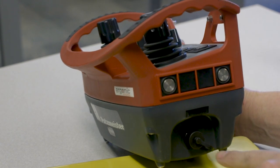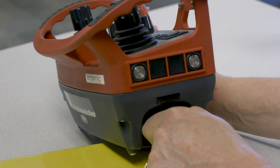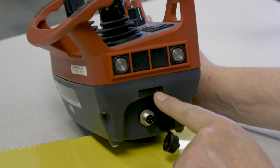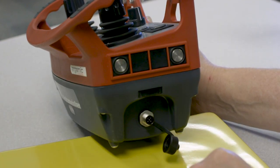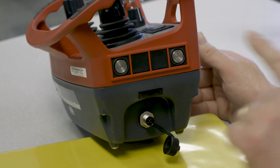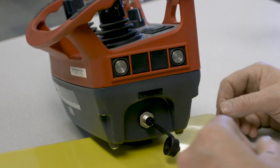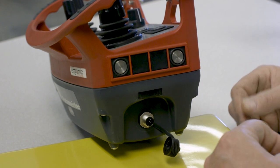On the end of the remote box, the hardwire connection — if we have a radio frequency problem — is the screw knob here; we unscrew it and screw in the orange cable to interface direct. Also, we have the iLog chip. The iLog chip is similar to a SIM card in a phone — it mates this transmitter to the receiver on the truck. So if this transmitter is damaged, I can bring another transmitter in, put the iLog chip in the second transmitter, and I'm back operating in no time. This gives the customer the ability to have several different pumps but only a few different spare remotes, and they can swap the iLog chip from remote to remote if needed.